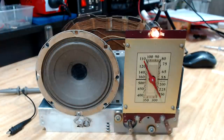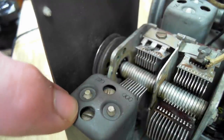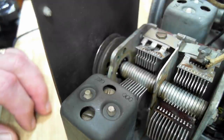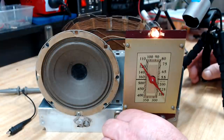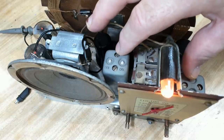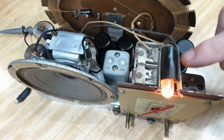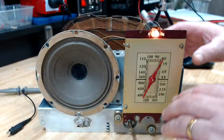What I normally would do now is the alignment, but I've done it to death on the last few videos. So I might just do it off camera. I'll put 455 through here — if it's okay I'll just move on. I'll feed a signal in at 600 and 1400 to make sure the dial's tracking properly, pick the antenna and that's it. Actually I've turned it on and there's an issue already. I've connected my signal generator through a loop antenna at 455 and there's nothing there. Obviously it's not set to 455. So I'll run my signal generator up and down until we find the signal. It's at 437 — couldn't get much further out. The IF is supposed to be 455, so I'm going to have to adjust it.